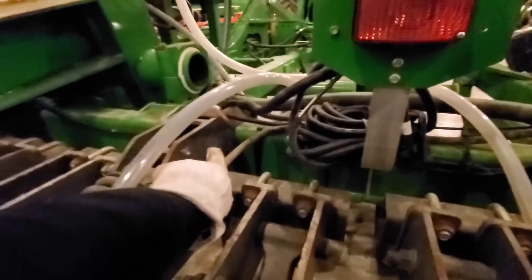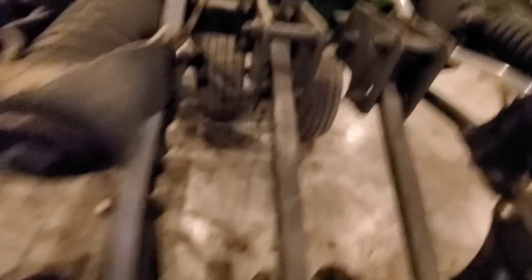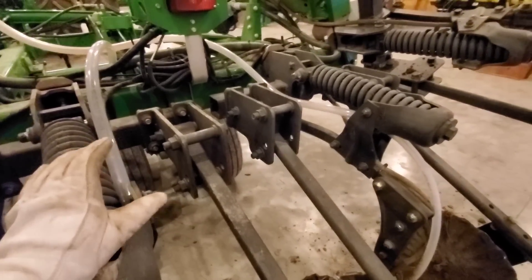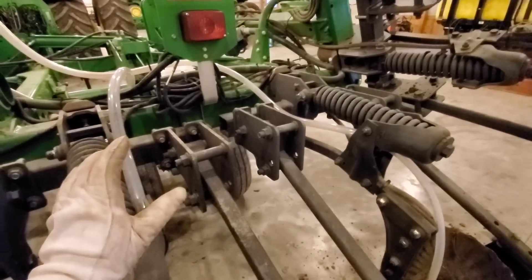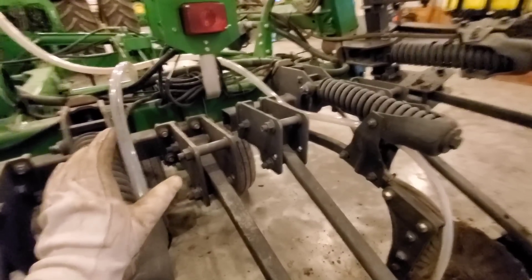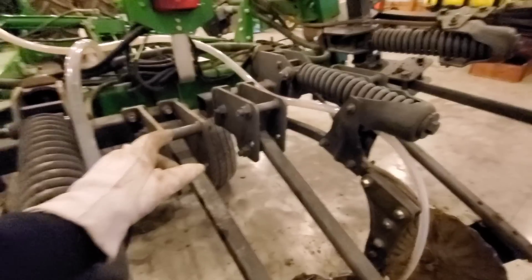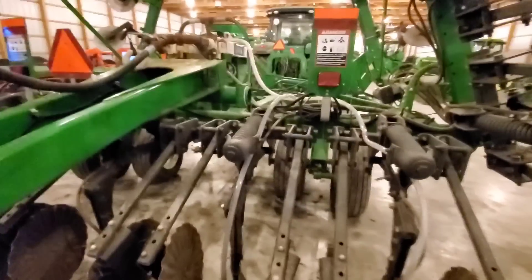This is a bolt-on shank unit. This piece is just a section of box tube welded on — these hang up around the shank and you can adjust them in or out and adjust the angle. There are quite a few adjustments you can do with them. This style is used on the S Medium and the C's. Ironically, the very first few serial numbers — probably less than 10 on the Mediums — came out with the 2510S Master closers, with a single coulter in front and hydraulic closers in the back, but they immediately changed that to free-swinging on the Medium models. The C model was discontinued.